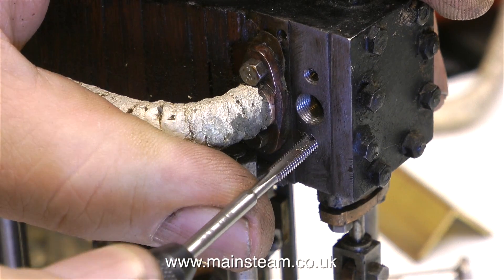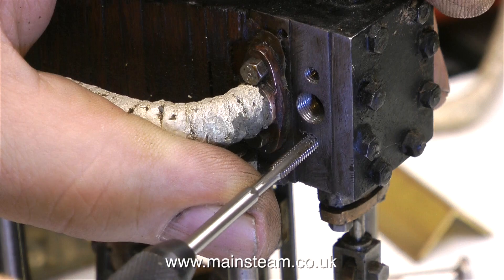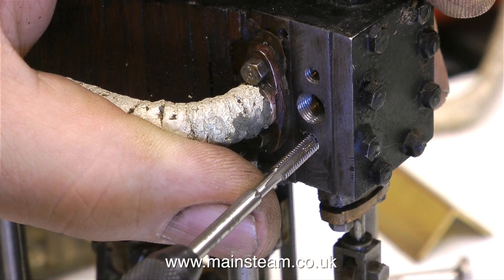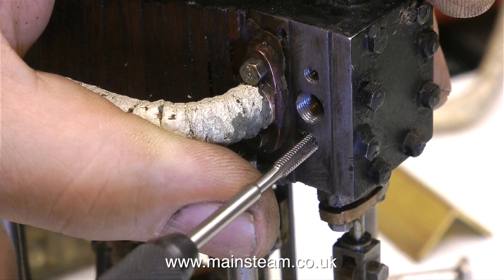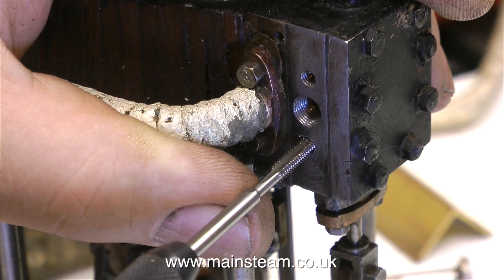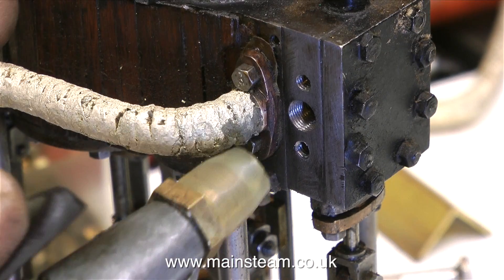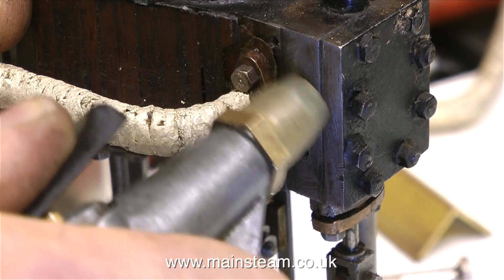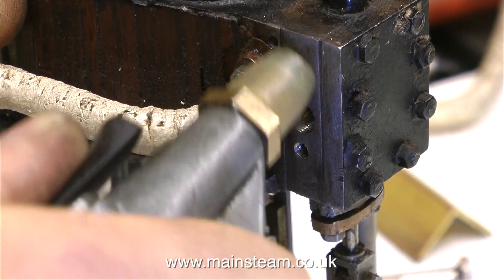This is a very new, quite sharp 5BA tap, and I've been extremely careful with it, because the last thing I want is for this tap to break off in the hole. If you look carefully at the nut to the right-hand side of the tap, you'll see it's moving — that's because it's just glued on. The tap touched the stud inside and the nut fell off, still firmly attached to a blob of glue. I will look into this in detail later and fix it.